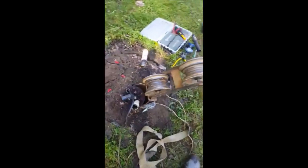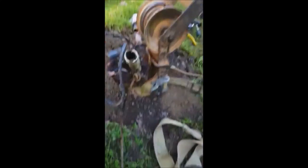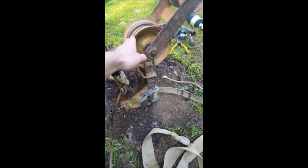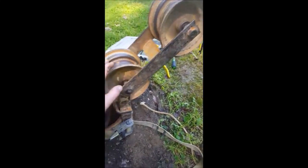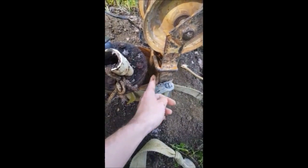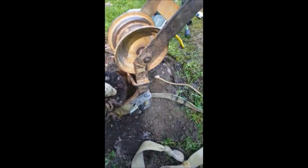Back at the well — this is the top of your pump with your well seal, and the pump is down at the bottom. We're about to pull it, dragging the black roll pipe across this device we made with two wheelbarrow wheels. Since the casing is so low to the ground it won't hook on the side, so we improvise with a ratchet strap, ratchet it to the casing, and roll it right across the yard. We just finished pulling the pump out of the ground.